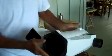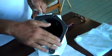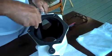The housing was the biggest problem. Number one, it had some corrosion. Specifically, if you look at the housing, this is the top of the housing and this is the bottom of the housing. So what we did was we found that this surface here had pitting, and the surface inside here had some pitting. And so I had to actually have this surface here machined at the machine shop, and they took it down 35 thousandths of an inch to make it smooth. I also went in here with sandpaper and took all the pitting completely out.